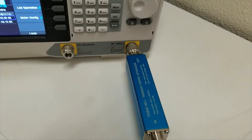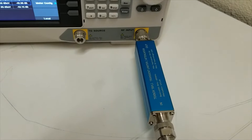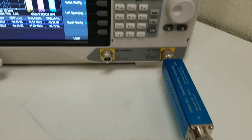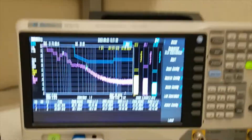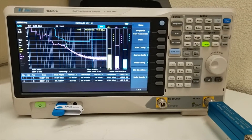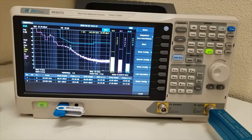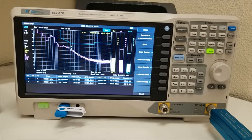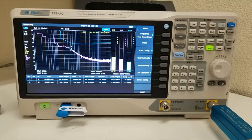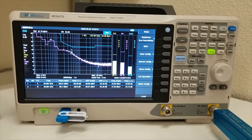You'll note that the output of the RF port on the LISN is connected up to a transient limiter, which will protect your spectrum analyzer. That has a 10 dB drop, so we must account for that. I have added corrections into this spectrum analyzer to account for the 10 dB drop in the transient limiter and also for any attenuation coming from the LISN itself. We just apply the correct correction files, turn them on, and it's ready to go.